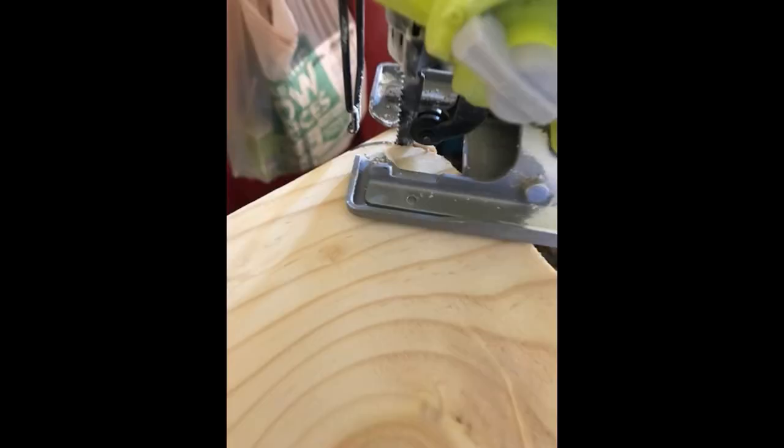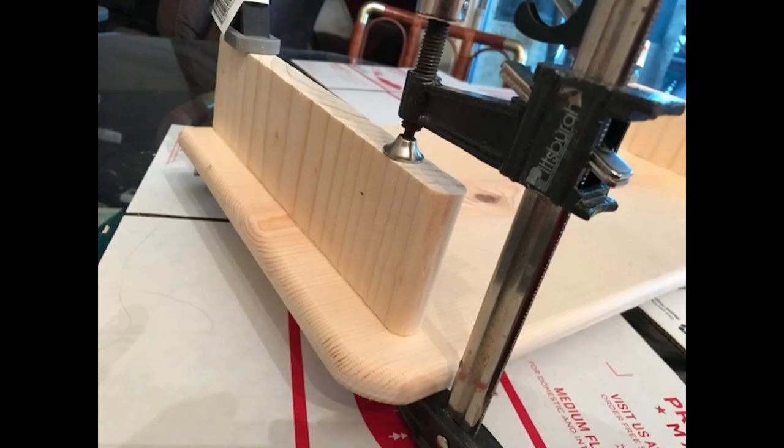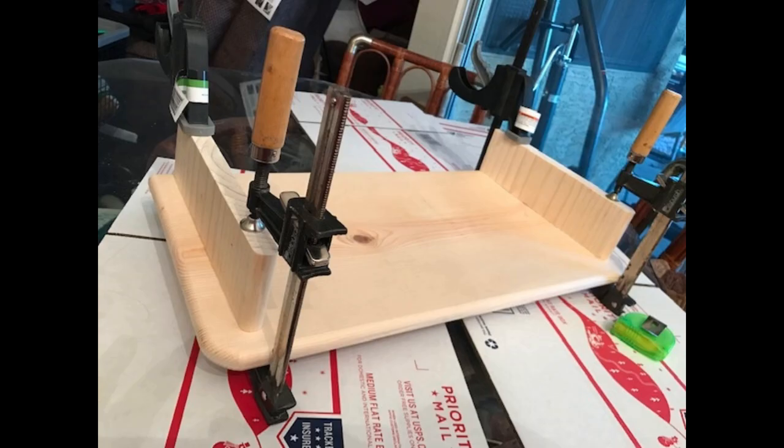I had a shorter length board to make the top part TV shelf and a couple of 3-inch pieces to make the uprights to leave a space in there for the DVD player. I glued the uprights to the underside of the TV shelf, then set all the pieces aside, spread them out to put some satin clear polyurethane finish on both the top and bottom sides. Two coats on each side took care of that part of the project. The longer piece you see is for another project, which I'll cover in a later video.